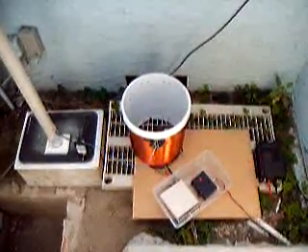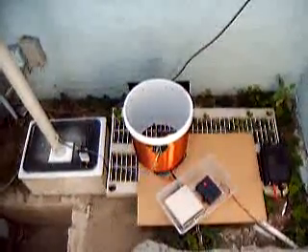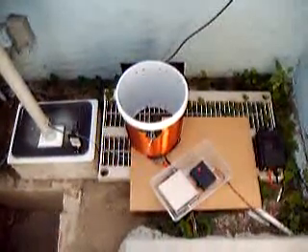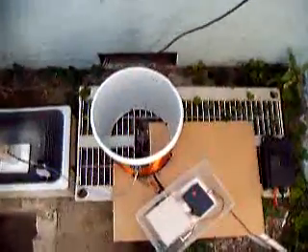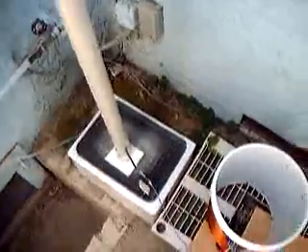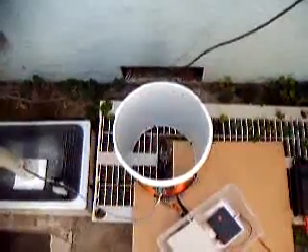Here's the electronics at the base of the mast. You can see the MFJ clamp-on RF ammeter next to the base, and you see that going over to the coil. The coil is connected to the AM-88 and the wind keyer, and the power supply there on the right. If I get in a little closer, you can see the ground rod in the center of the coil. Working off the ground rod, I have radials going under the house — you might be able to see some wires going under the house there. Those are fairly large cables that actually fan out once they get into the house, with multiple radials under the house.